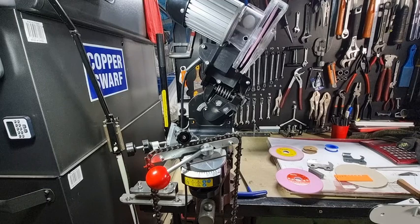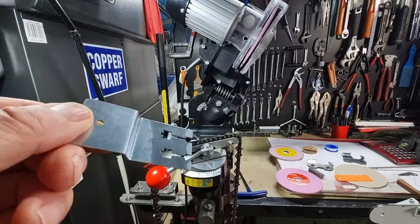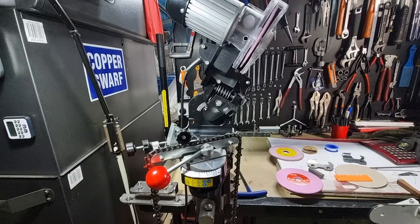The wheels come in three sizes: 3.2 millimetres for 3/8 low-profile chain, 4.7 millimetres for 3/8 chain and 404, and 6 millimetre diameter for doing rakers. Personally I would never use a wheel to do my rakers — I always do them by hand using a progressive depth gauge. I don't believe using a grinder is an accurate way to do rakers. I've promoted the progressive depth gauge many times — it sits on one individual tooth, which is why it's superior and more aggressive than your standard flat constant gauge.